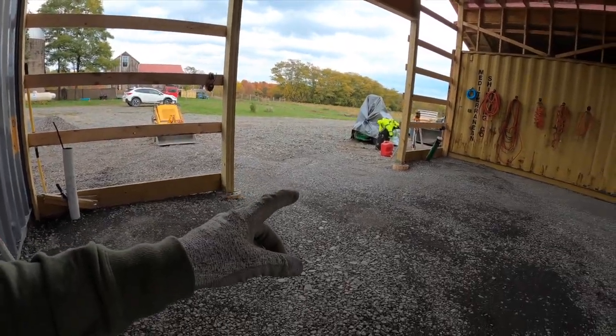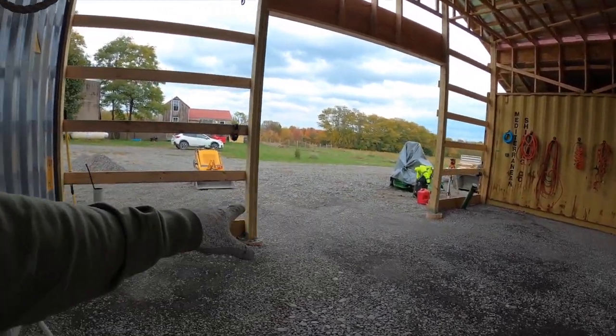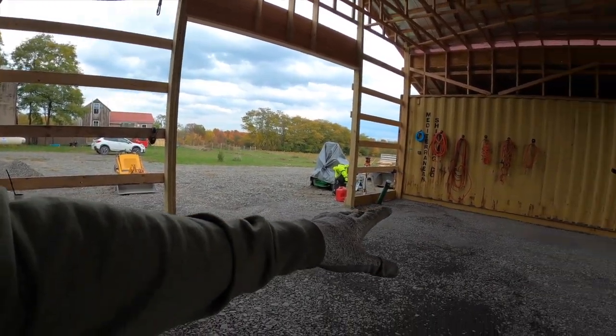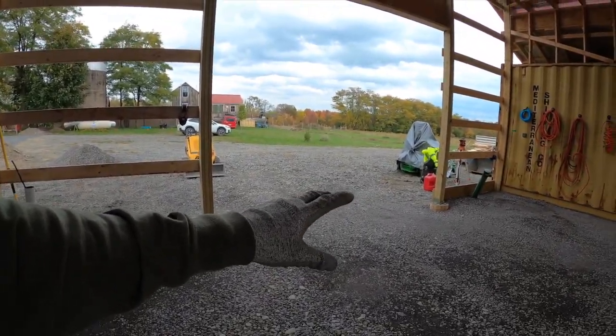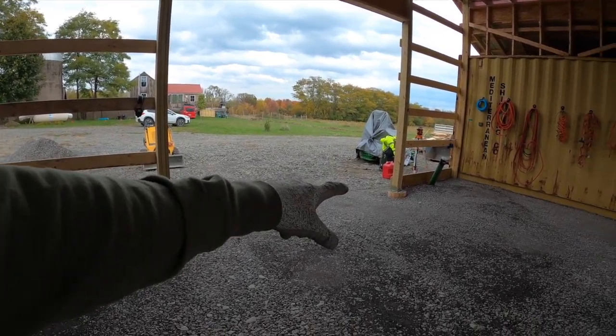The concrete dude, who by the way, his name is King. So the King wanted a little bit of a taper. So that's why those two piers, you can see them. He wanted to taper down to the door. So the full slab is gonna be about 4 inches and he wanted to come down to about 8. I'm somewhere in the 8 range, just right in there. I think he just wanted to beefify it so it didn't, you know, crack at the mouth of the entry.